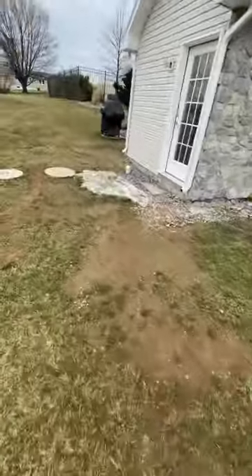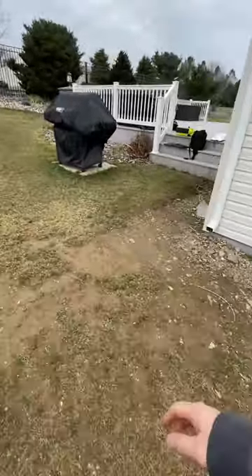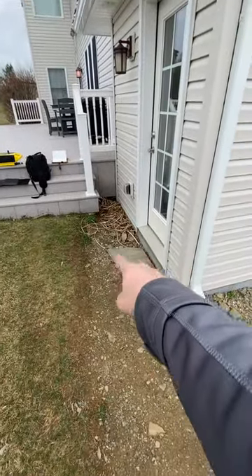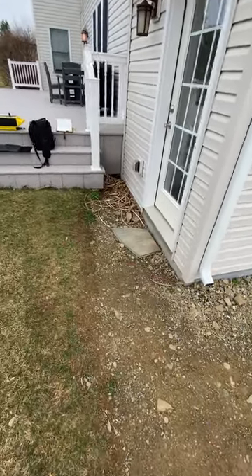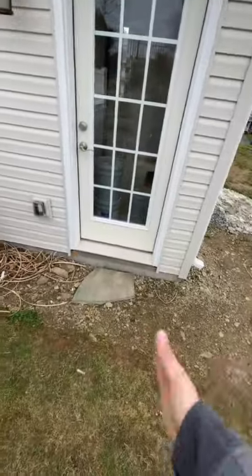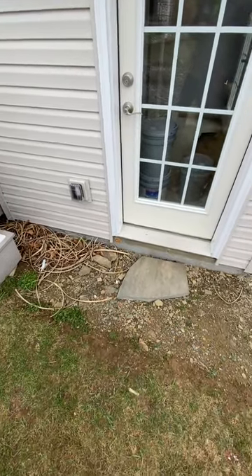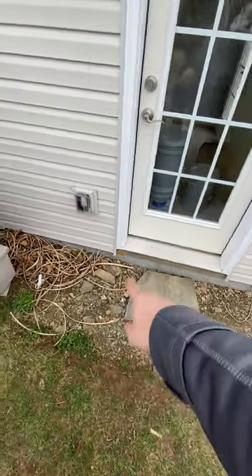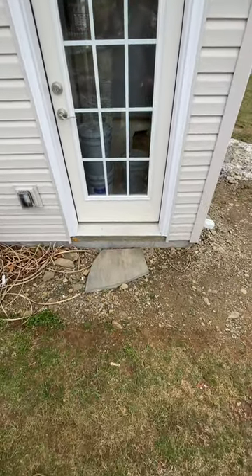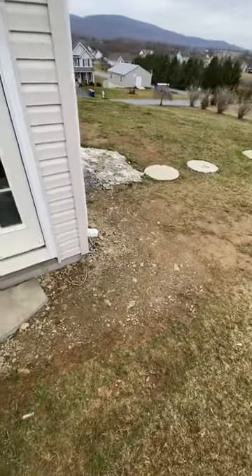Pretty straightforward. Just going to have to make sure all these grades match up. This area is going to have to get backfilled in here again. We want this to slope away from the house — it kind of naturally slopes away. We're going to have to backfill this in here as well. We want it coming up to the bottom of the siding, just like the other ones, so I'll have that grade in the OneNote because I think it's going to be challenging to show on the measurements.